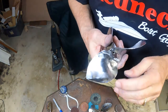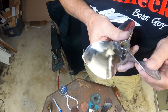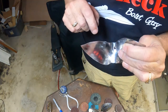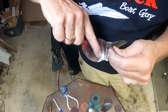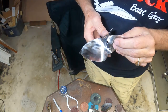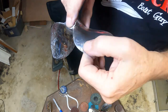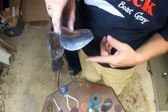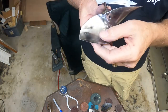Running across grain to knock some of the high spots off — you can help it smooth out too with how much pressure you're putting on that pad. That prop blade is getting better and better. I could polish it out from there, but I can still see quite a bit of grain. That green one will take most of that off, but it's a little hard to get up in here without getting back on the same grain pattern. You can see all the knuckle bumps on the back where I've been building acceleration shelf into it — beating it up, putting it on the brass block and beating it down — which is changing the arch here and how much pitch is on the leading edge.